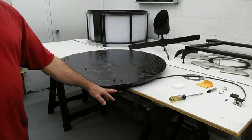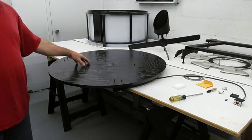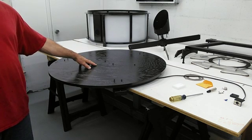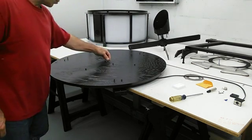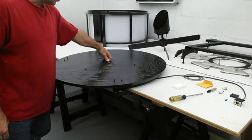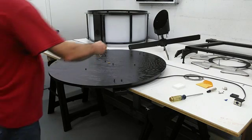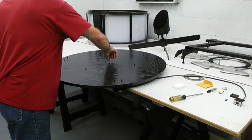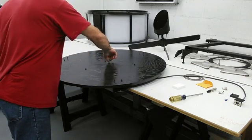I flipped over the triangular frame and lined up the drive board to the appropriate holes. It only goes on one way. I started the screws. There's a bronze bushing that gets pushed into the center, so I'm going to push that in, and then install the same bolt, screwing it into the threads until I get to the shoulder of the bolt.